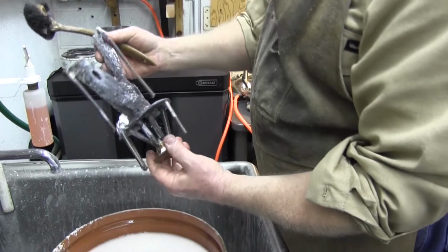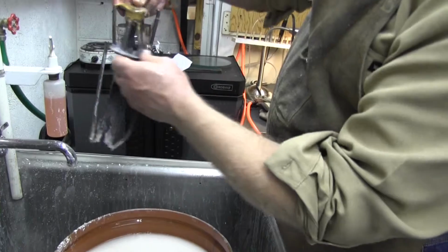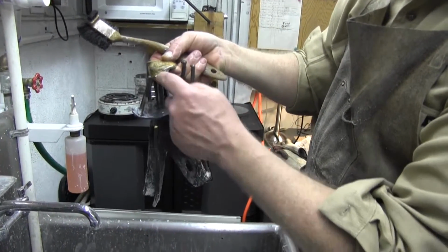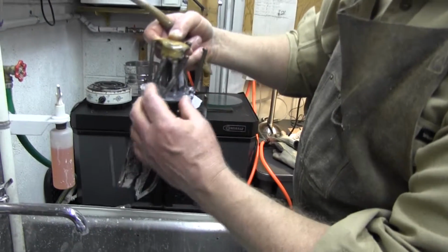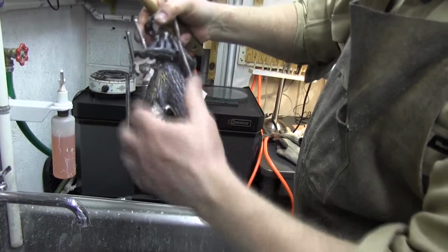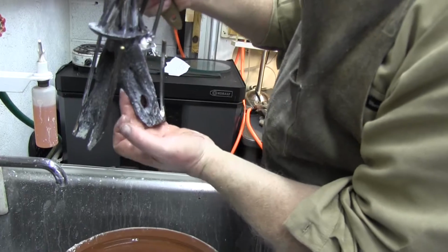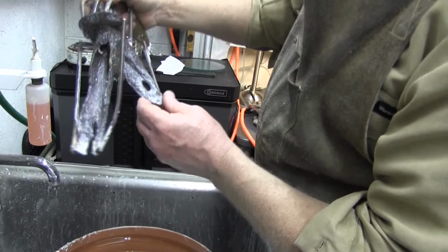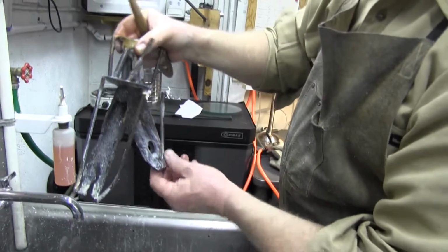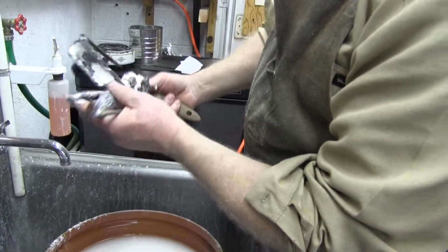It's exactly how I fashioned the wax. In this case, I used a main sprue gate former right here, and then used multi-sprues into the flat area and had vents to the outside. And then this was filled at the bottom, but there was an air hole so that the air could escape when the investment was poured in. And then the bottoms are the vents that allowed the air to be displaced as the model was filled up.